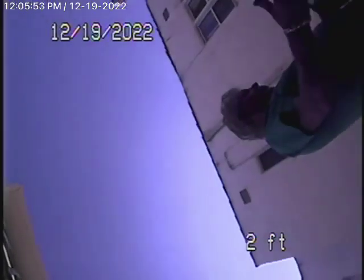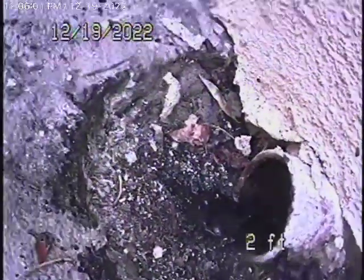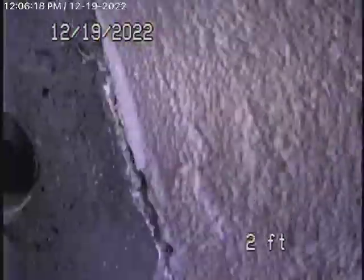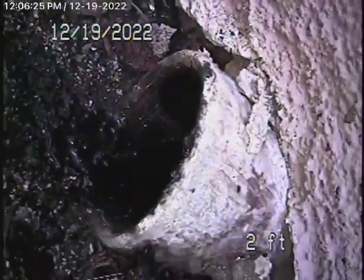Basically, the kitchen line has a lot of grease and it looked like it had a belly in it. The cast-iron pipe under the building — the main line all the way to the property line — is obviously getting old, but it still appears to be in fair condition. The pipe in the street was in fair condition — clay pipe, no major problems with it — but it did have some minor roots. We definitely want to recommend that the kitchen line be repaired and hydro-jetted, and that a clean-out be installed outside where the pipe exits the house, and hydro-jet the pipe going out into the street.